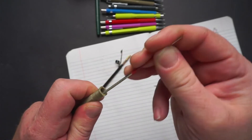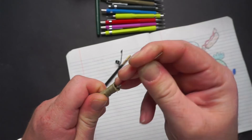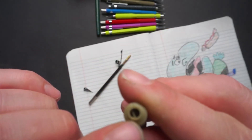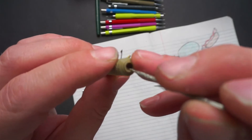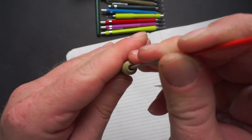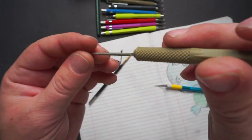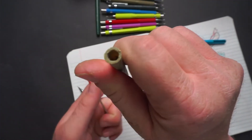I've gone about 90 degrees through the barrel and I can feel it's nice and smooth. Let's blow it out. Sometimes there'll be a little bit of filament left in the tip. I'm going to just gently, without reaming this hole, pry it off — maybe catch the end of it and rotate around once to break that loose fiber off. If it's there — it's not always there. Then I pass my needle file through like this to get it, and now I have a nice clean bore.